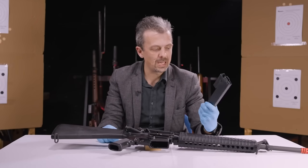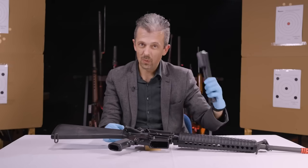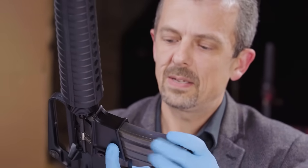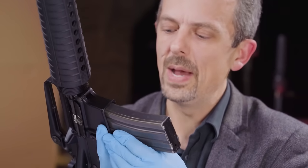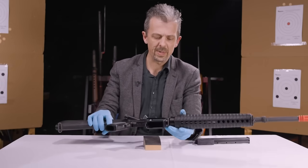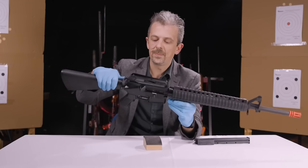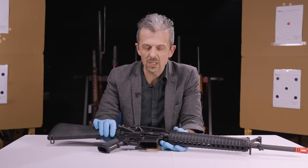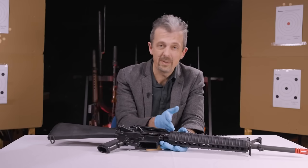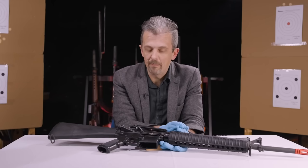Why would you convert an infamously not-always-very-reliable British submachine gun magazine — 9x19mm, of course, from the Second World War era — to an AR-15? You might be minded to try to insert an AR-15 magazine into this, but it won't latch in place, and there's a good reason for that which you will see shortly. Converting a 5.56mm self-loading rifle to 9mm is not as simple as adapting the magazine to the magazine well. Different cartridge case dimensions. You need a 9mm chambered barrel, of course. You probably don't want to be using your Stoner gas system — you probably want to turn it into a blowback-operated system.